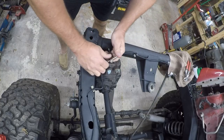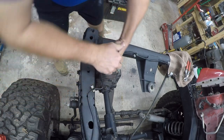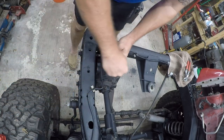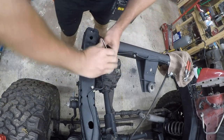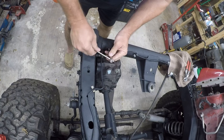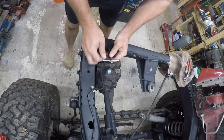Freeze the chips or the pieces that are being cut out. Those pieces provide friction, and that's what'll break your taps: friction, bending, and too much force. The smaller the tap, the more likely that is to happen. Little taps love to break in places where you can't get them back out.